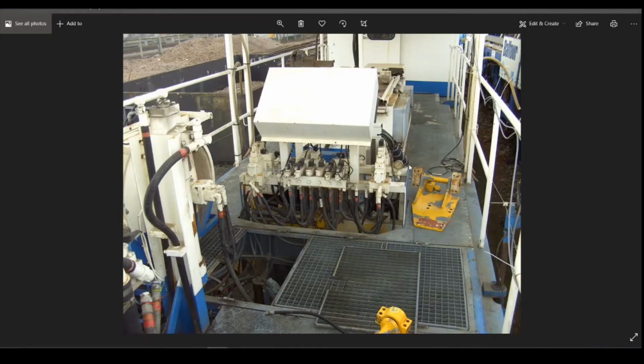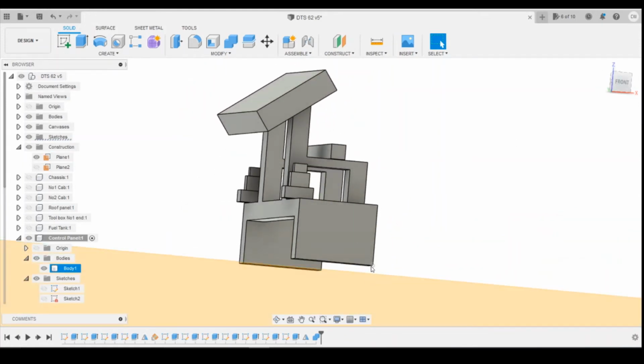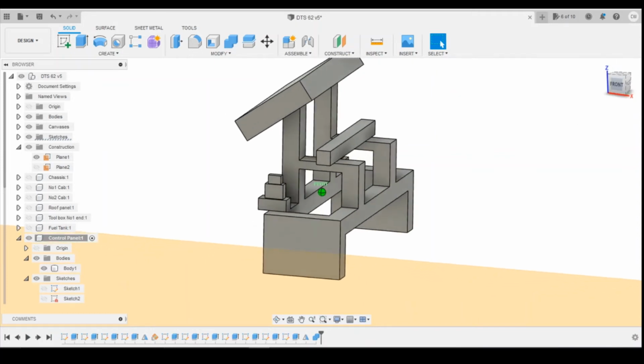Okay, I'm going to try and show you how to do something that we've not done before, and that's a 3D line. So we're going to be going from this point here upwards. I'm just going to create a pipe that's going to act as this conduit. Now this one I think we will be able to print because it's relatively thick, and when I print this, I'm thinking I'm going to orientate this to start printing this corner. So these will be connected as they go up and will help to form that.